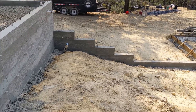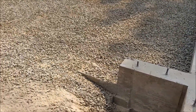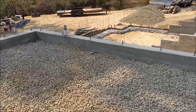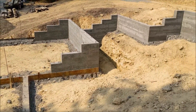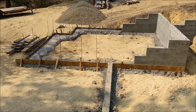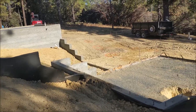There's a garage on the left — that wall is going to be the clothes washer drain, and then the sewage pipe going through the footing that we looked at earlier. Before the slab could get poured in the garage, all of the biomatter needed to get taken out, the dirt laid flat, and then backfilled with crushed rocks so there won't be any settling or cracks in the driveway. You can see the basement down there, and the crawl space is kind of a mess still but that's going to get cleaned up. It is going to be a pretty large crawl space — that's why the walls are so high.